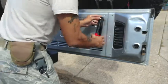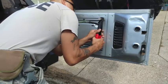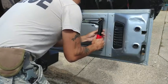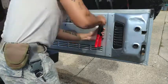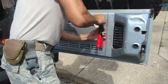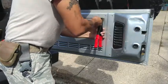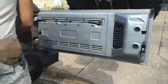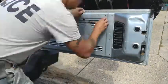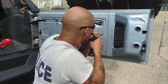It's pretty self-explanatory. You choose the proper adapter that you want to use — in this case 6-32. Screw the rivnut on, insert it into the hole, make sure that your handle is parallel to the tailgate, and squeeze it just like a regular rivet gun. It's going to squish that rivnut into the hole, and you back out using the knob. It's important that you keep it level while you do this; otherwise your threaded insert is going to end up being canted.